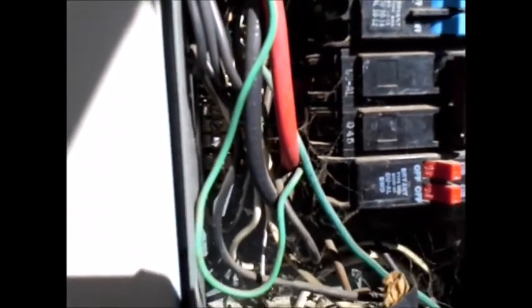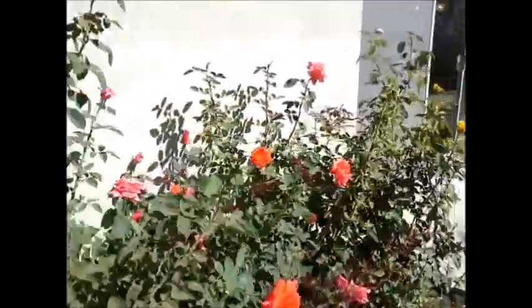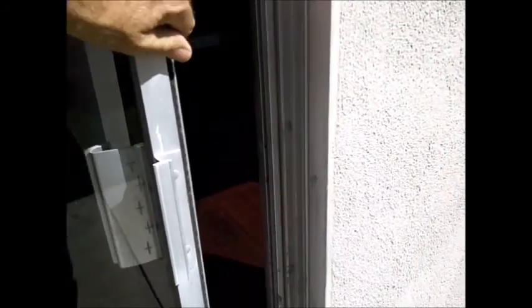And it's come back to haunt us. Where the wire twists around a screw, it'll crack and short out, and that's what you have there. So the house needs to be gone through with an electrician and repaired. The pigtail with a little piece of copper, and to repair all the outlets, all the switches, receptacles, and so forth.